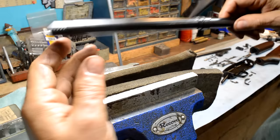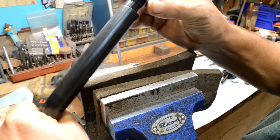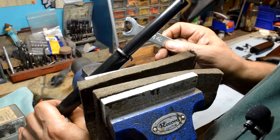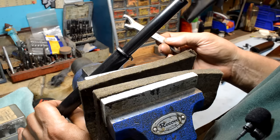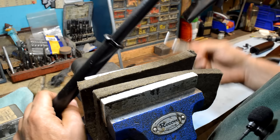And in this particular case, you see these here? That's going to run up like that, and that's right. So now in order, we've got to put the wood back on first, but in order to get this on and tighten this up, we're going to need a spanner that fits over the top of this. I didn't have a Model 42 4-inch spanner, so I made one out of a wrench for tightening up the chuck on, I guess, any one of a number of routers that were in here. Whenever you make custom tooling like this, always label it and stick it back in a bespoke toolbox.